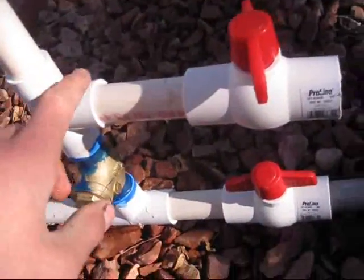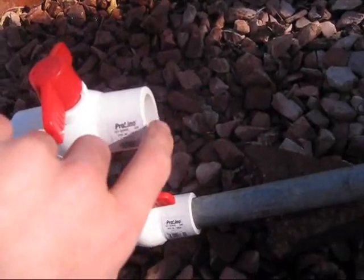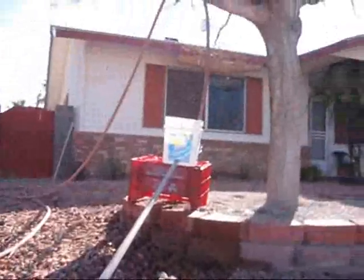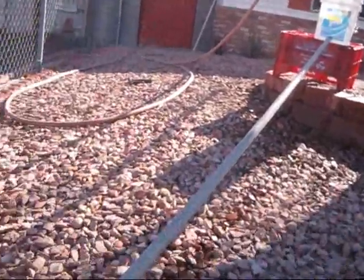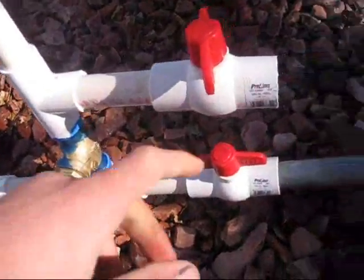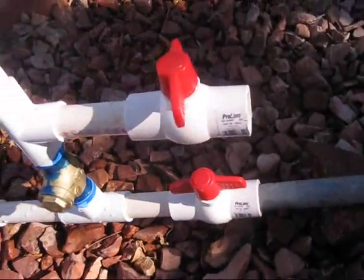And then this is your output — you have an output valve. The output from this would go up higher than your stream or whatever you're running it at. So basically just using gravity and the stopping of the water, it pumps more water even higher.